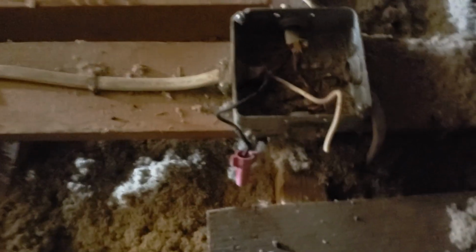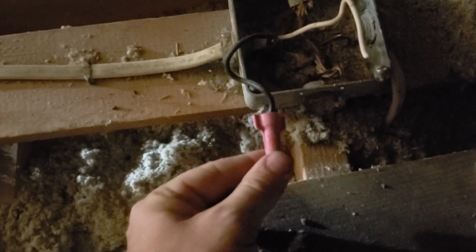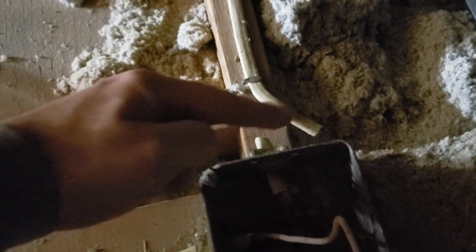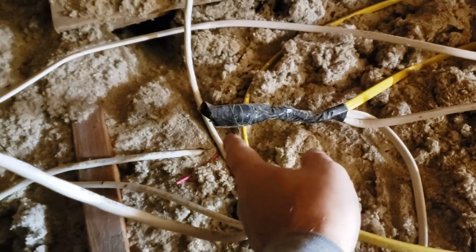And then there's some junction boxes here, and this looks like maybe older wire, and I'm assuming that these are not hot, but I don't really know. I'm not sure if they're cut off or not. These wires are cut, and there's just wire hanging from the ceiling. There's wires draped over everything. Some more wires that are just taped off. I'm not sure what they go to or went to. This is the stuff you have to be careful about when you move into a house.